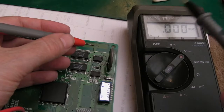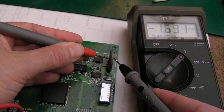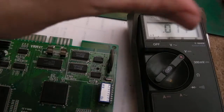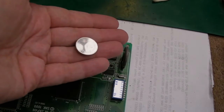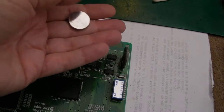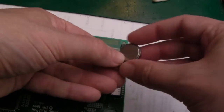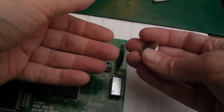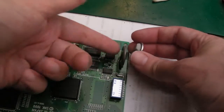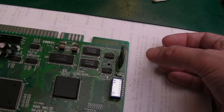It charged up to about three volts yesterday and overnight, but then it had gone to zero. It's been on for an hour and is at 1.7 volts — and ten minutes ago it was at two volts — so that battery needs replacing. Finding a replacement is quite hard these days because they don't make lithium-ion rechargeables in that physical size anymore. This replacement is slightly smaller — about 40mAh — but it will hold power for a number of weeks when the board is not powered on.